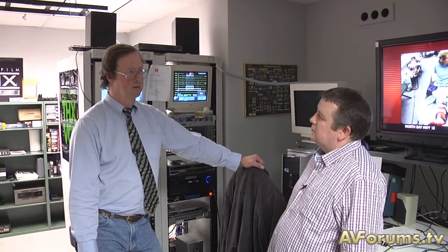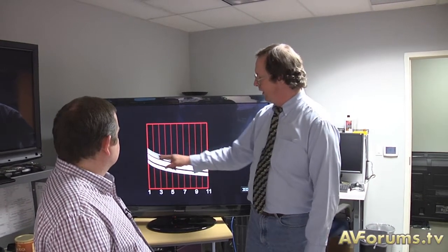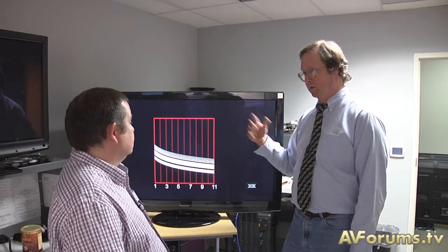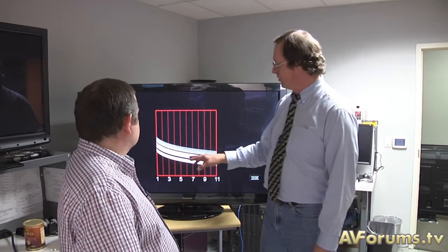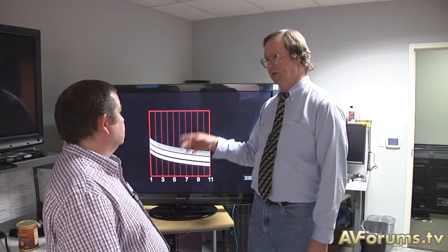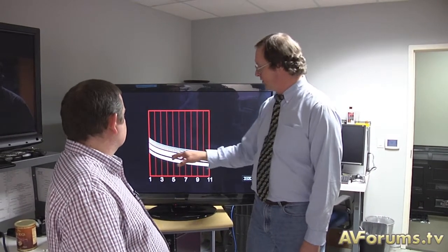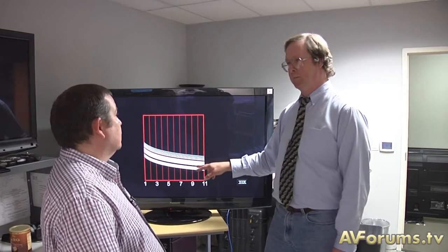Zone plates are pretty good tools to see what's going on with high frequency processing on moving objects. This is the jaggies testing — let me explain it in a bit more detail. This test has curves and three sections: one is a black and white high contrast section which starts the pattern, the next section is a red and white stripe going back to what people are used to seeing in older images, and the bottom part is a checkerboard. The checkerboard shows artifacts in the processing — there will be blockiness instead of a smooth ripple. The stripes hopefully stop having a jagged edge somewhere along the curve, and the further down the curve it goes, the better the processing is for the jaggies.